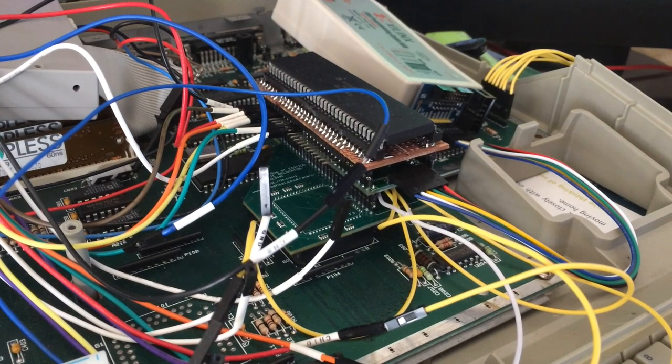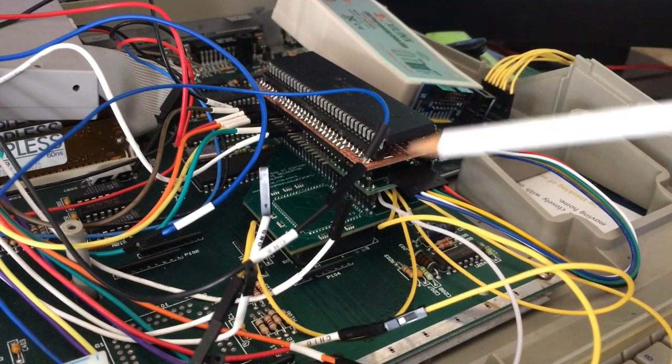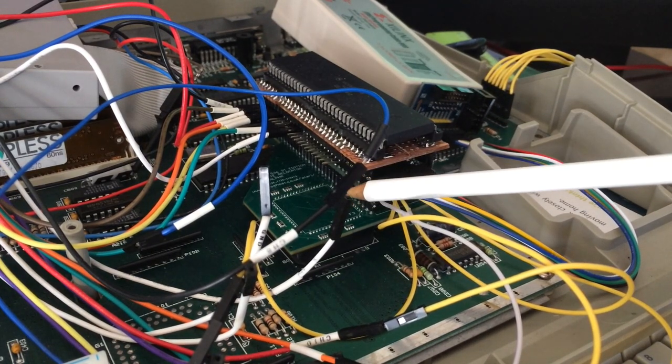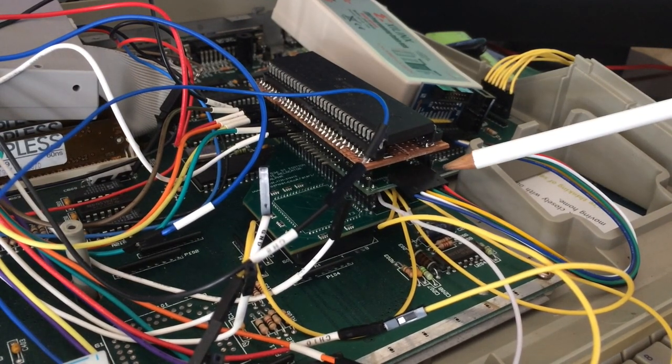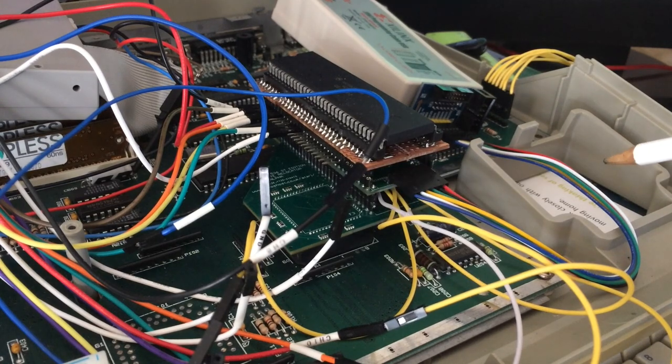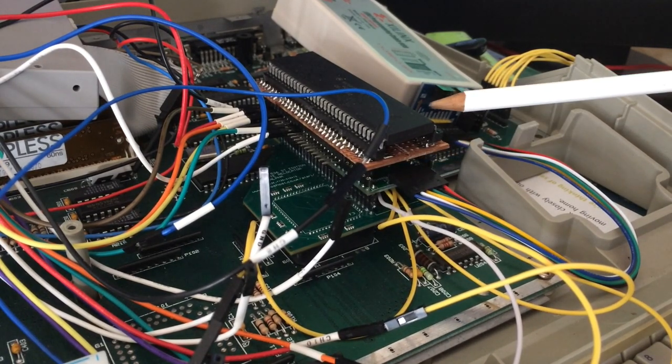Okay, so we've done a lot of building so far, so I thought maybe it was time for a little bit of a show and tell. So here we have the assembled prototype stack. This is the PLCC to DIP64 adapter that we spoke about and built previously. My little experimental prototype board is plugged into that. Now, because I got my pitch wrong on the DIP chip, I've had to have a little bit of a reconfiguration, and this is the adapter board that I've got then set on top of that. And on top of that is my